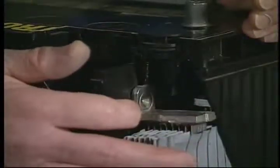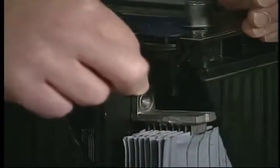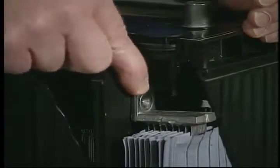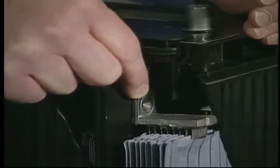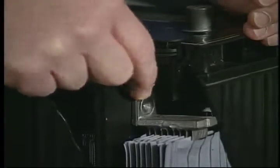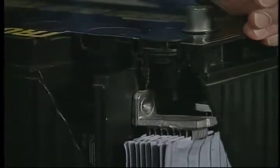We then take this bus bar and what we term the tombstone up in this part, and we weld through the partition with a 1/2 inch diameter. This accumulates our voltage from cell to cell for the 6 cells we have in the battery and gives us a 12-volt John Deere strongbox battery.